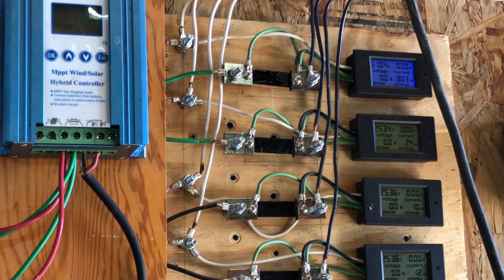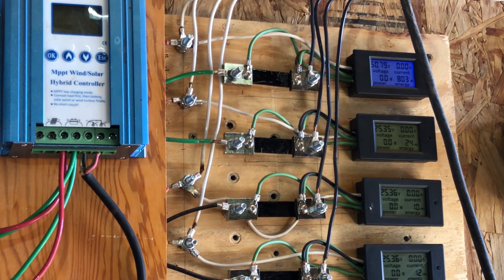My drill does not like that — it's working hard. Running it on a 48-volt circuit we're looking at about 200 watts from this drill, which is what I generally see it max out at anyway — 200 to 250 watts. So I think this stator will work well on a 48-volt circuit.